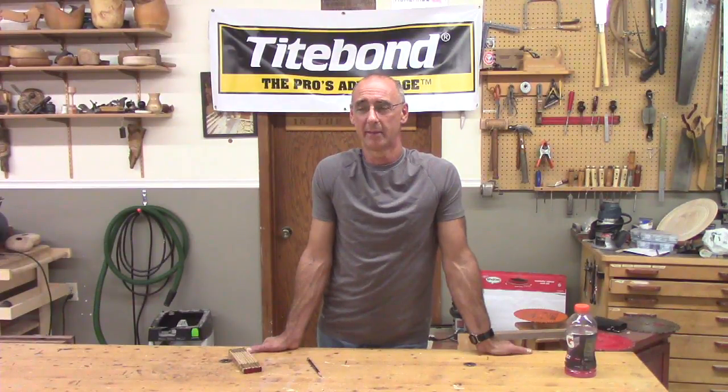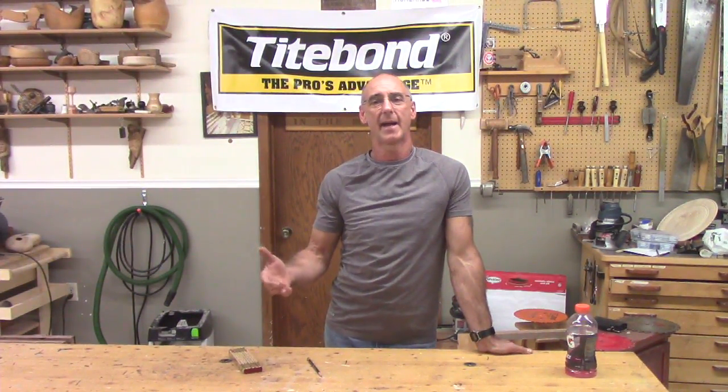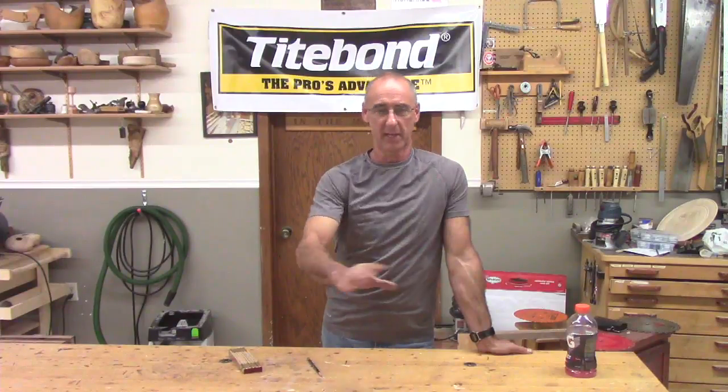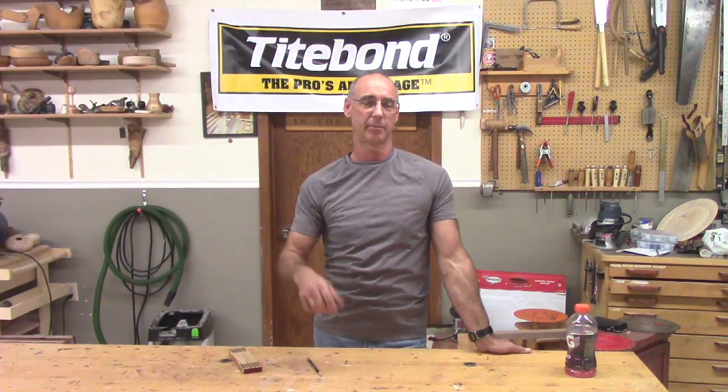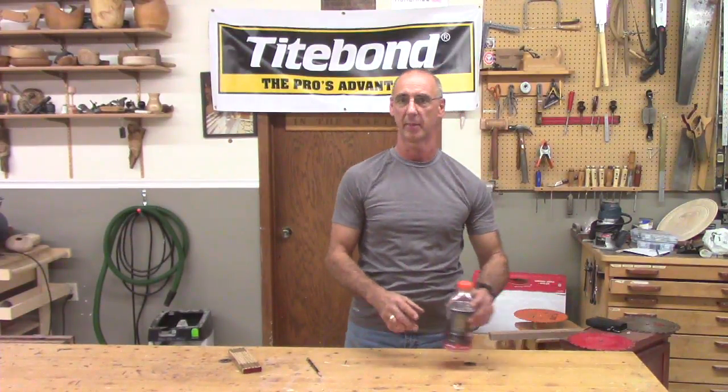So my gut is saying just go with the best floor finish that you can put on there, and as she taps away on it, keep an eye on it, and when it needs to be refreshed, sand it, put another coat on, and you'll be okay. Just don't let her tap through the finish to the veneer, and I think you'll be okay.